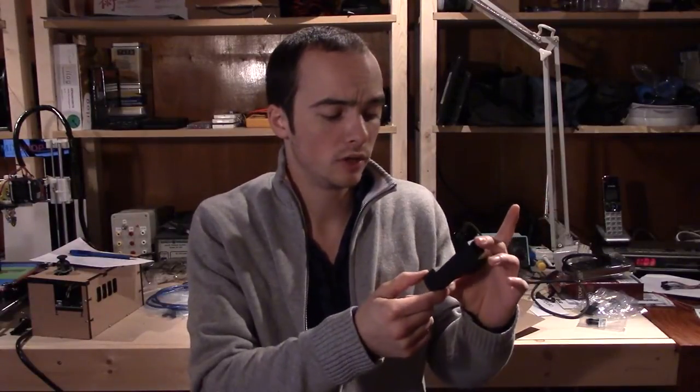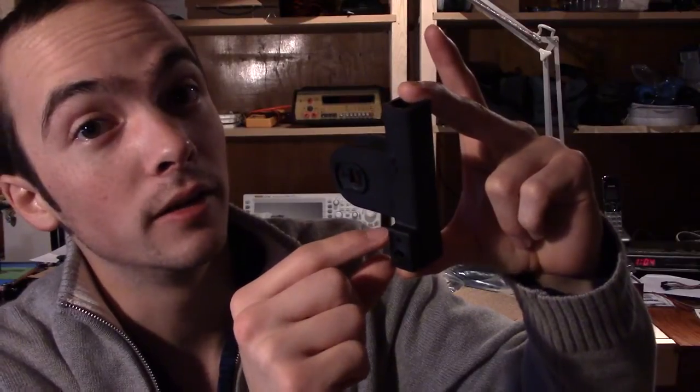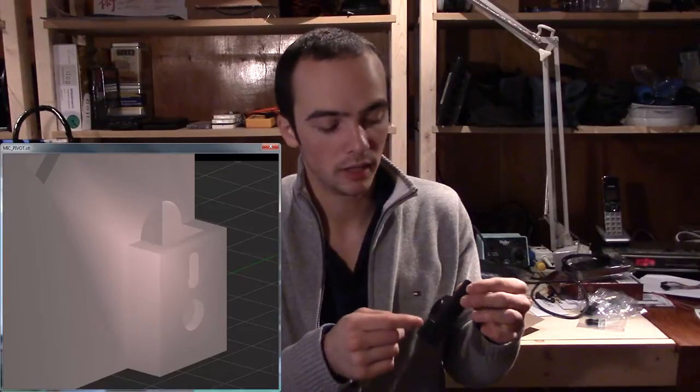And the last spot where the overhang occurs is on this other lock block. So with this microphone stand pivot joint here, you could actually adjust how far the microphone comes out from the center axes. You could see the overhang right there, okay? To fix that overhang, I just simply cut that out. But then I realized there's still a bit of an overhang on the main block that braces the microphone boom. And so you could see I kind of cut that out as well in a half circle so that I could just ease back into constructing slash printing the main axes of alignment. Yeah, you'll have to pardon my terminology because I'm no mechanical engineer, okay?